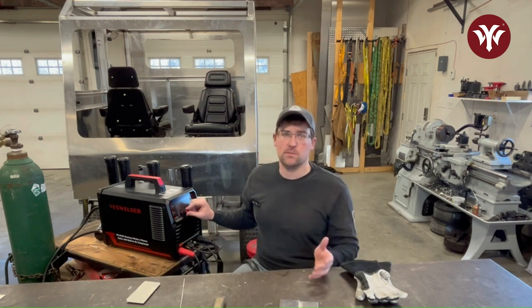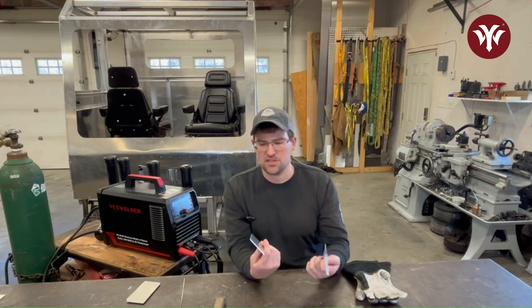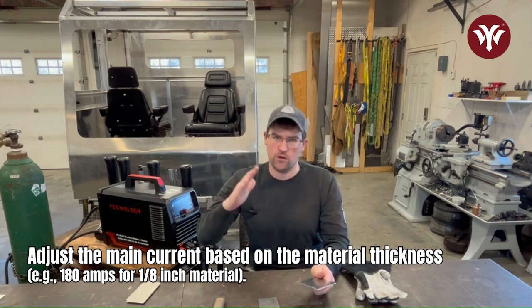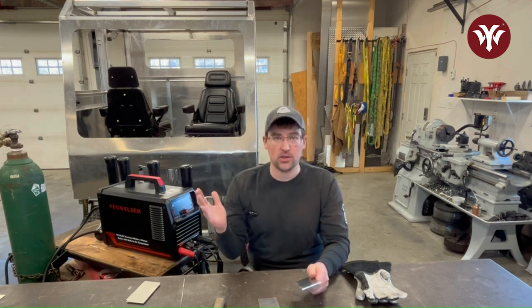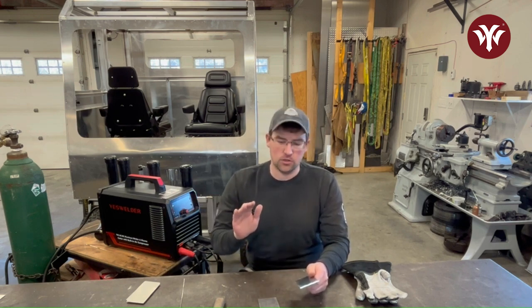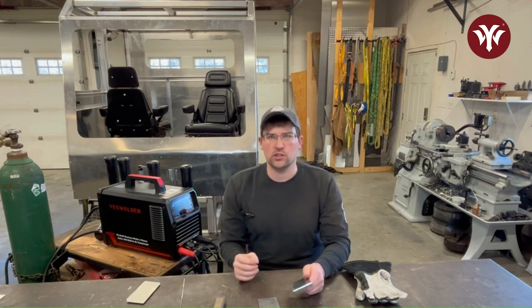Your main current is pretty easy to understand. If we're doing 1/8" material, I'm going to set that machine to about 180 amps, which may be a little bit above where I'm actually welding. Then with the foot pedal I'll dial in the current — I'll ramp up high to get my puddle started, and as the base metal warms up I'll back off so I get a nice puddle that flows with really good heat.